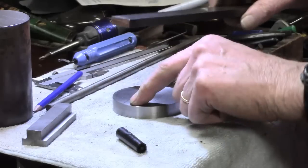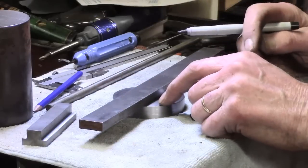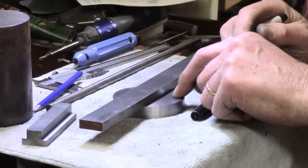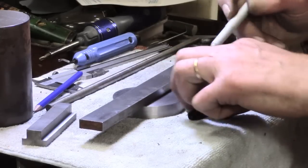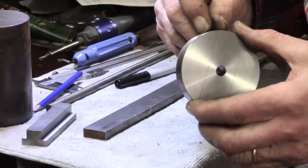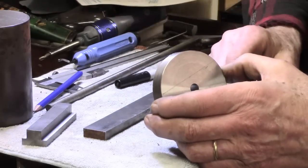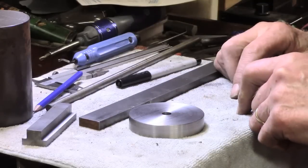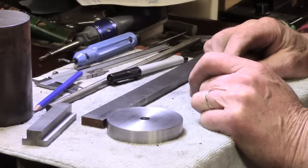So I want to mill out this center section for the bar, and then on one side, only needs to be one side, we'll mill that down to get rid of 3/8, same thickness as the bar, and then we'll have 3 set screws for locking the bar, and probably somewhere on the outside opposite the set screws on this side where we've got all the meat, we'll drill that and put in a cranked handle for rotating it. As I say, more than once, I'm not going to get a very big result out of this for a ball, but if I can make a 1 inch, I'll be happy with it.